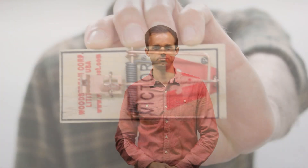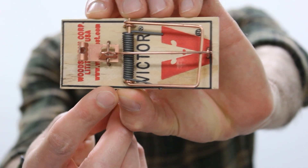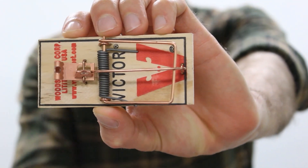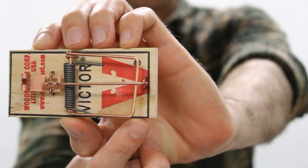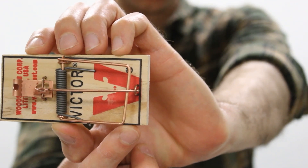But how? I'd like to say it's the power of a positive attitude, but the real answer is even better. Often times, it's a spring. A mouse trap is a good illustration. The trip plate, representing the sensor of the fire damper, releases the spring, which powers the arm of the trap to snap shut, like closing the grill of the fire damper.